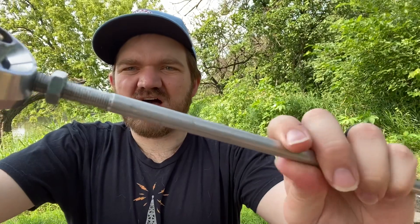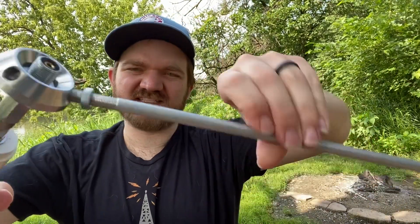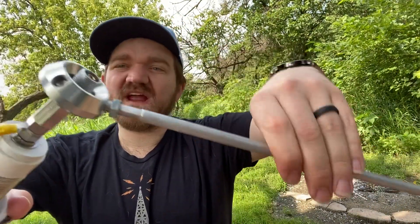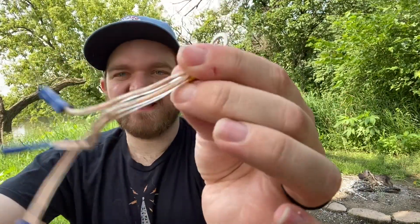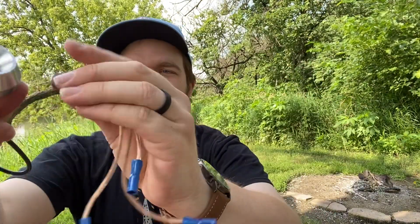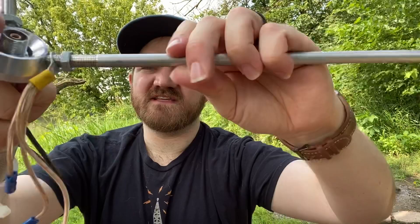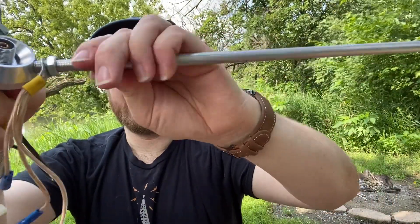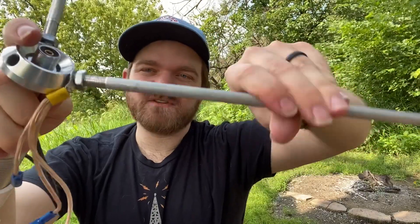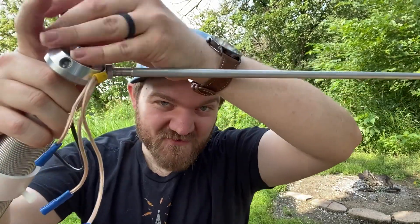On the bottom of the coil here is this little aluminum milled piece that the tripod legs screw into. They're just a three-eighths inch fine thread rod that's partially threaded, which screws into those three positions. The radials — the grounding part of the antenna — also attach at this point. I've made this little adapter, which is a large ring lug to three bullet connectors, that I trap with one of the tripod legs into the structure of the antenna. Rather than attaching all three radials separately like they ship them, this adapter makes it a lot easier once the tripod is set up.